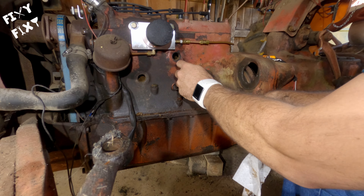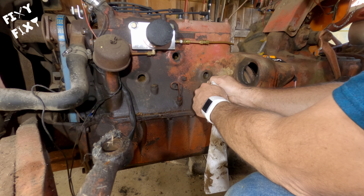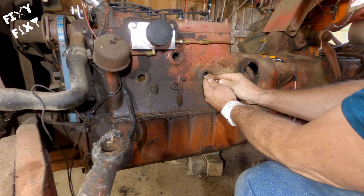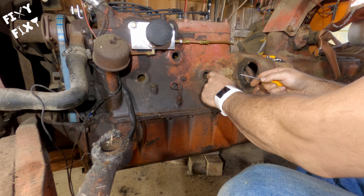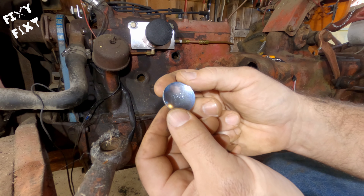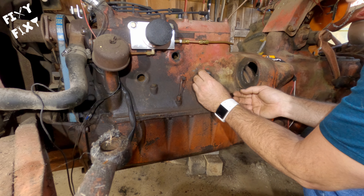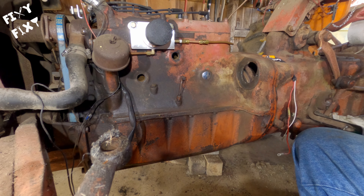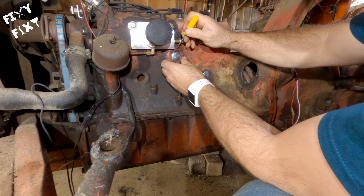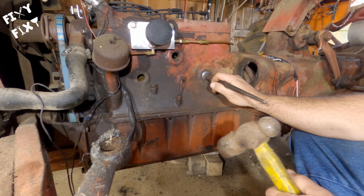Knowing that this machine was made from a lot of parts - the motor's from one thing, the trans is from another, I know the radiator and some other things are off of the 2N - I can only assume that motor specifically sat outdoors for a very long time, but never gave me any clues about the problem with the water jacket. It always ran real good. I've seen reviews that'll talk about using sealant or some product when you seat these in, but they didn't come with any extra additive and seem to work really well used as intended. So I did not add any extra material - I just made sure the lip they sit in was good and clean. That one gave me a little trouble so I had to clean it up a bit more, but that was it. You just punch them in the middle and try to flatten them out.